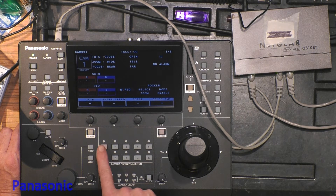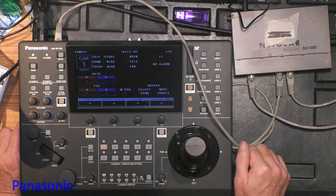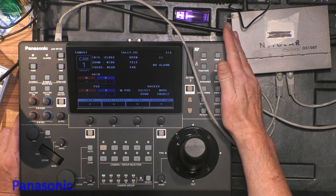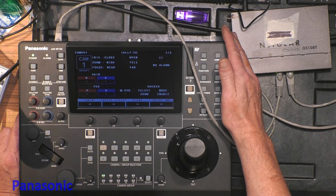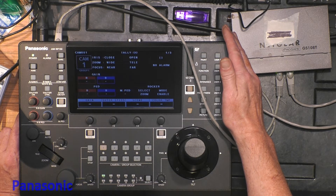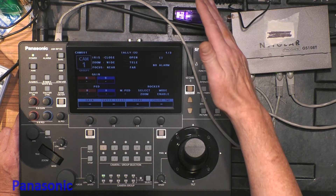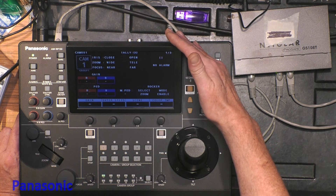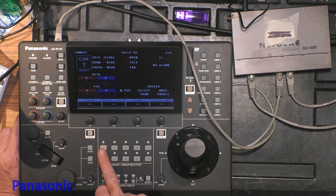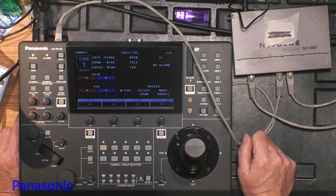Still no light is coming. Of course we need to tell the panel to work with that camera by IP, and it needs to know the IP address of the camera. Since the camera is on its initial address, it will be 192.168.0.10, and since that is already pre-configured in the panel, if I select camera 1 as LAN it will be connected — very simple. But if you don't know the IP address of the camera, we have some tools that might help you.